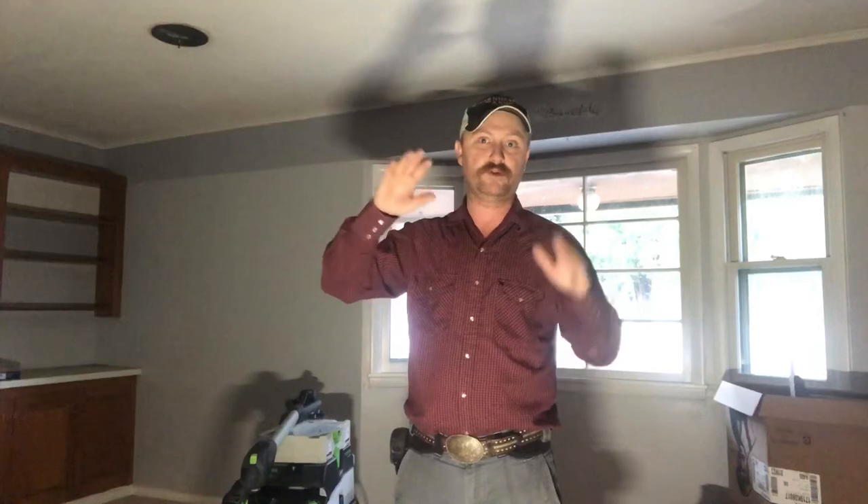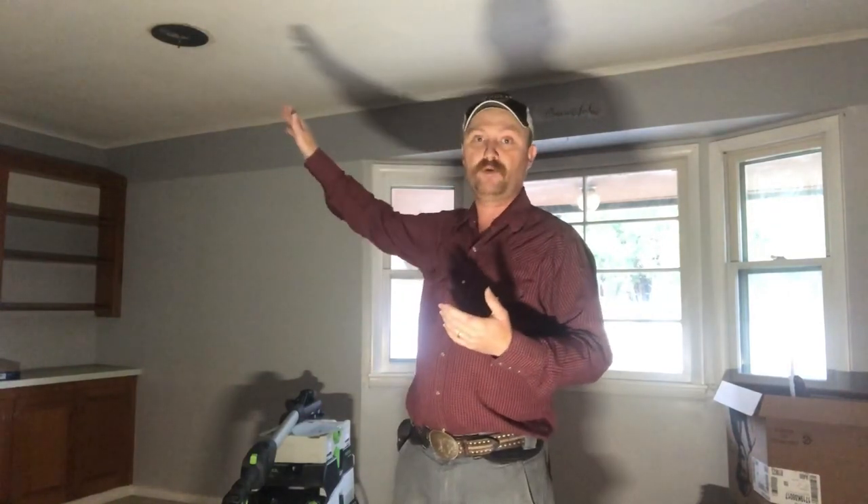My first experience using this — I've done about four or five rooms in the last two days with this one sander. Started in a lady's bathroom, knocked it out. It had never been painted — an 8x10 ceiling — took it to where it looked like we'd hung brand new drywall; you could even see the tape joints. We finished that out with 80 grit and a light pass of 120, no damage to the paper, looks factory. Took 30 minutes.